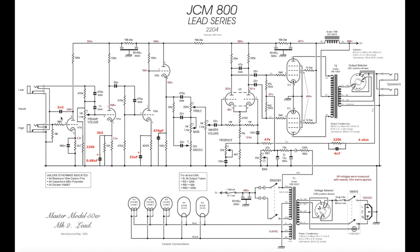Reducing to 2N2 knocks out a lot of bottom end, keeping the preamp nice and tight, preventing it from getting too woolly. In high gain amps, if you're not controlling the bass through your circuit design, as the signal goes through the amp it becomes woolly and you lose tightness. The idea is to keep bass lean in the preamp, then get some punch back in the power amp. Also, you'll put a 220K resistor in parallel with the gain pot.